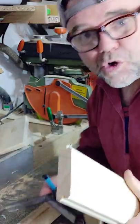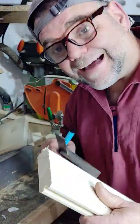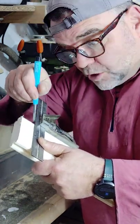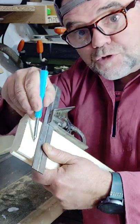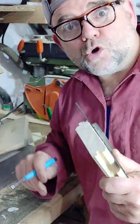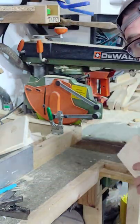Well, there's a really simple woodworking tip that you should employ. Whenever you mark your piece of wood to length where you want to make a cut, you grab your square or tape measure and mark your piece of wood where you want the cut to be. But then you should put a little tick like so, and then you know that it is the waste side of your piece of wood.